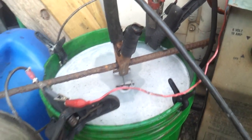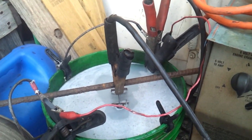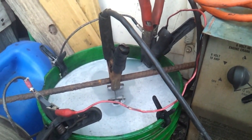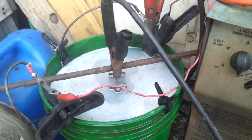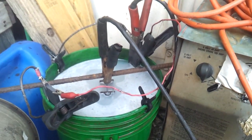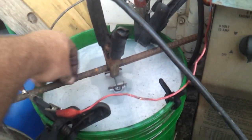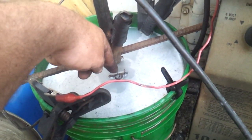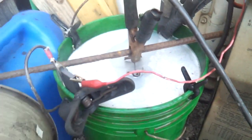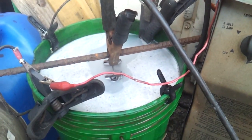I may add a little washing soda every now and then — most of the time I just stir it up before I put the next part in. Electrolysis does work, it does clean parts well. I think it's a lot easier than sandblasting because you can hook it up and walk away. I recommend doing it outdoors. If you've got to do it inside, open the doors and windows because it will build up the wrong type of gas and a spark will — you won't be happy afterwards. All you will need is the bucket, the battery charger, something to hang your parts on, and remember: your negative hooks to the part and your positive hooks to the graphite. Thanks for watching guys.